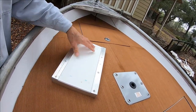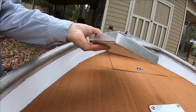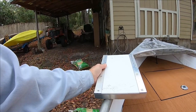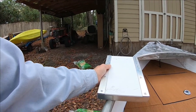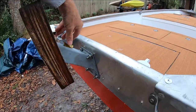This is going to be my mounting platform for the trolling motor up on the bow. It's a couple of layers of half-inch PVC sheet reinforced with aluminum angle, so it's super rigid. The idea is that it'll go up here where the trolling motor will be easy to access and out of the way, and won't interfere with any of the hatch lids.